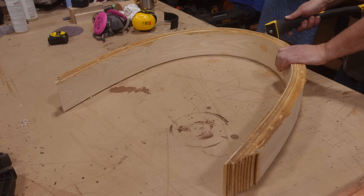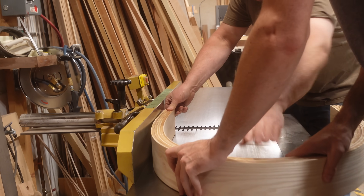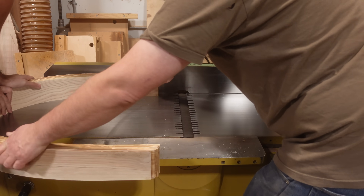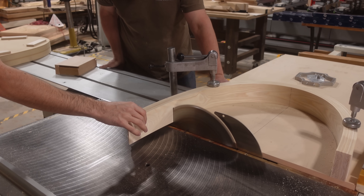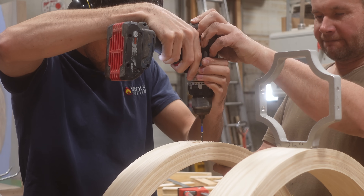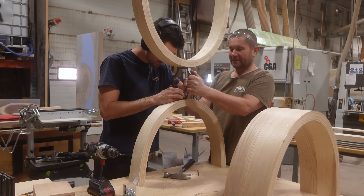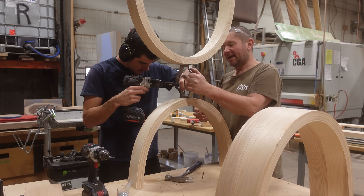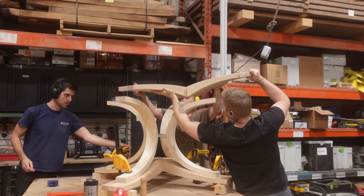With these curved shapes we do have to make some non-standard operations. Here we're using the jointer with two people safely, curving the piece over that big open blade just to ensure we get a nice flat bottom. Then it's time to cut the pieces down to their final length — we use our SCM panel saw with a sled clamped to the table and the curved laminated pieces clamped down as well. Another detail the client requested was a high-polish metal detail joining the four center laminations, which we had custom machined by a mill shop. Even just that small detail was $1,400 at our cost before any polishing or finishing — just to give you an idea of costs associated with something like this.